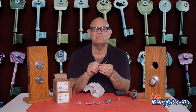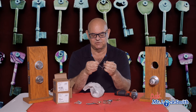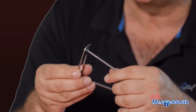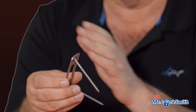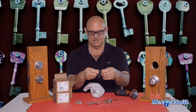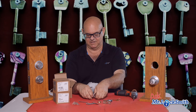This is such a simple install. Don't throw these away — these are three-inch screws that go on the frame of the door. You just put in these three-inch screws and it really makes the door harder to kick in. It makes the frame harder to kick in, so your door usually gives way first. Out of the box, three-inch screws and a nice plate — if you put this in it should catch the stud and make the frame way, way harder to kick in.